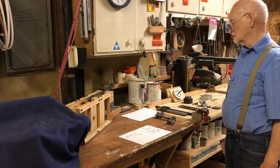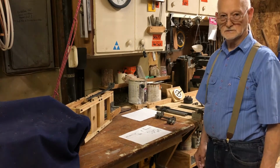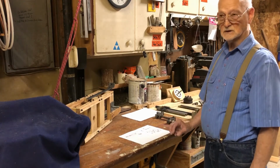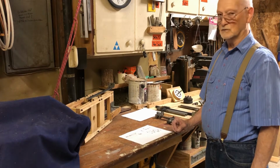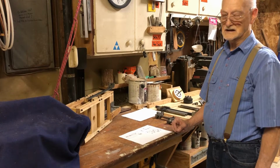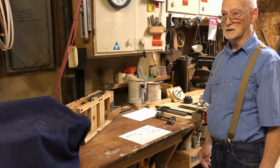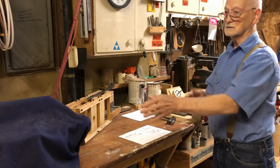Today I'm going to show you the parts and things that I'm working on. If you saw my last couple of videos about the bicycle assist air motor, this will be a continuation of that project. The last time I tried it on the bicycle, it worked, but not very well. It was a 2-cylinder, and the RPMs that drove the bicycle wheel weren't high enough, so it was very jerky and didn't have enough power when I thought I needed it. Now this one is going to be a 3-cylinder, so there will be an overlap of 2 cylinders all the time, which means there won't be any jerky motion like with the 2-cylinder. It'll be a smooth, continuous roll instead of a jerk, jerk, jerk.